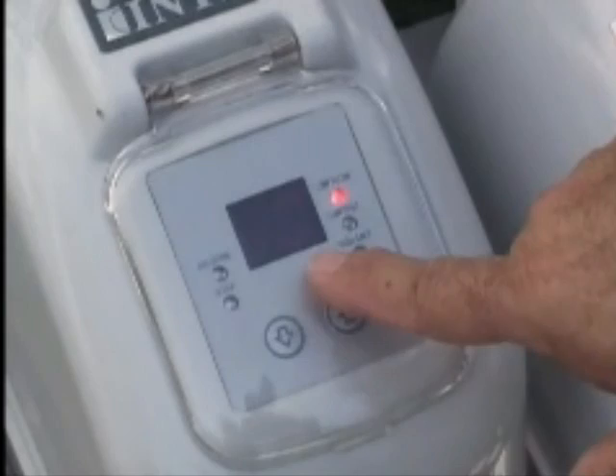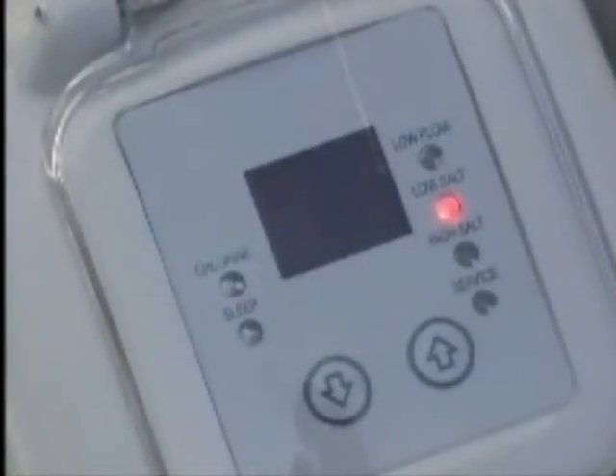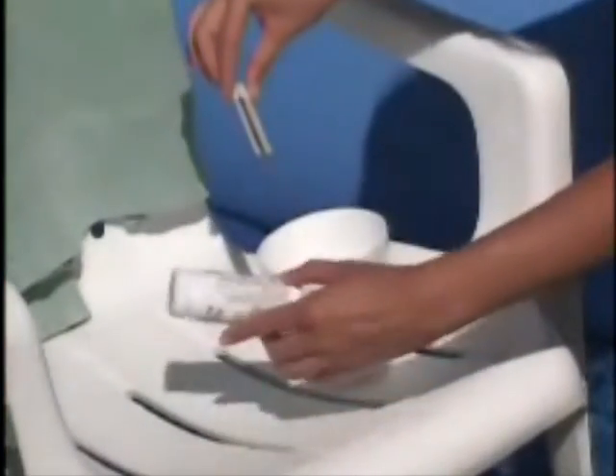The low flow LED light and code 90 indicates low or no water flow. The problem can also be caused by loose connections, water flowing in the wrong direction, plugged or closed hose lines, or the filter pump not running. Code 91 indicates low salt — refer to the manual for adding the proper amount of salt. Do not restart the generator until the newly added salt is thoroughly dissolved. Code 92 indicates a high salt level and can only be remedied by partially draining the pool and adding fresh water. You can use a salt test strip to help you determine how much the water must be diluted.